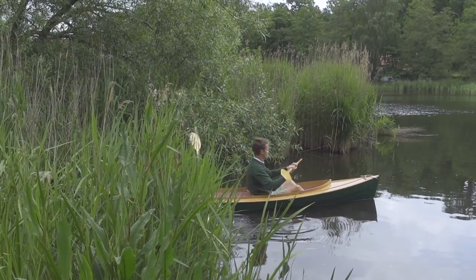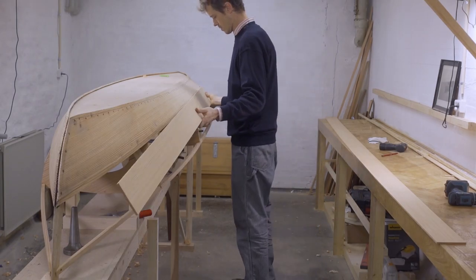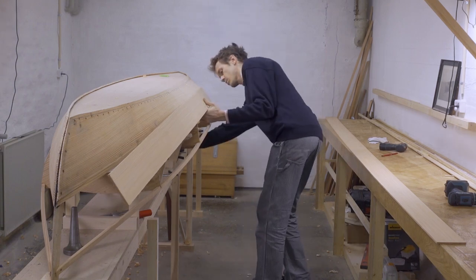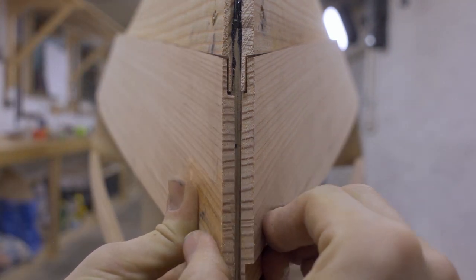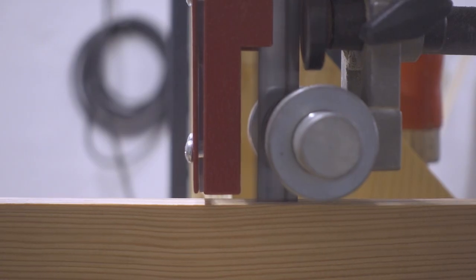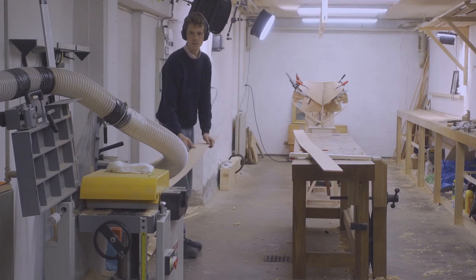This video is a brief introduction to how the beautiful Fiddlehead Double Paddle Canoe is built. The boat is built using a so-called lap strake dory construction technique. Lap strake means that the planks that cover the side of the boat overlap. At the overlaps, the plank thickness is almost doubled, which increases the strength of the hull quite dramatically. With lap strake construction, you can use very thin planking while still getting a very strong hull. This makes it ideal for lightweight boatbuilding.